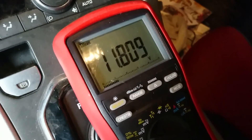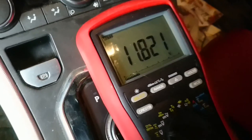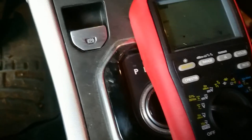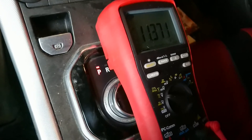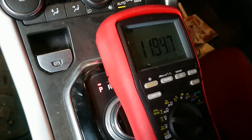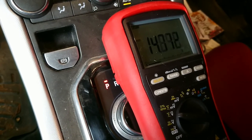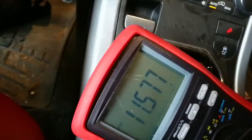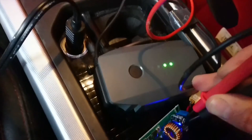We're in the car now. Just to see - when the car's off we've got 11.8 volts, which is a bit low; it should be like 12.4. This charger won't charge until we get to 12.5, as I've shown before. Start the ignition and you should see it bob up to 14.8-ish - 14.9 almost - and it's giving us 13.1 volts output. So it works.